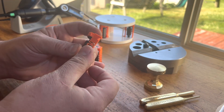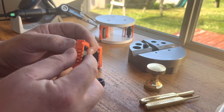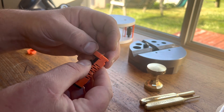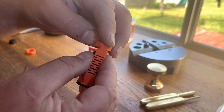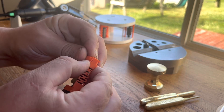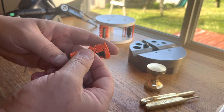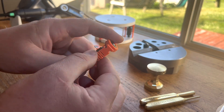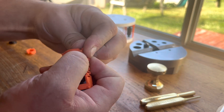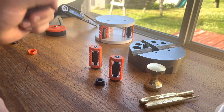The springs are also controlling and locking the rotation of the nut and screw together. We want to pop in the lower tab, then adjust the screw up until it's actually too advanced — maybe even one more. Then we'll stretch the spring and clip it in, and now we have axial preload. Oh, that might have been too much. There we go — that's our jack assembly.